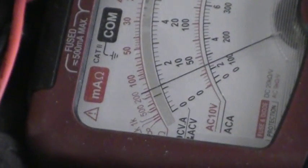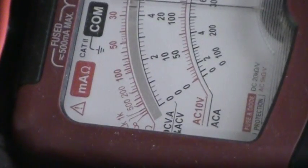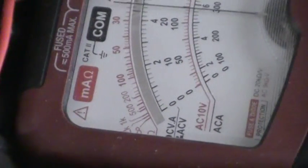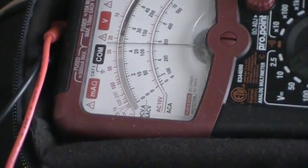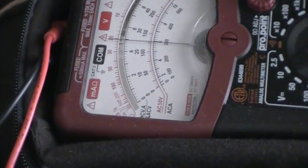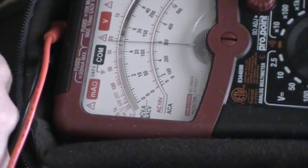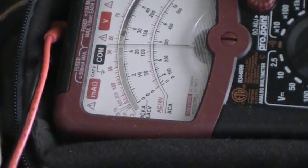I've got an analog meter hooked up here, and it's on the 50 volt scale. Now I'm going to set it to the 10 volt scale. As you can see on the 10 volt scale, I'm just under 5 volts. The reason I'm just under 5 volts is because these LEDs act as a voltage regulator — two LEDs, each one is about a 2.5 volt voltage drop. If I unhook them, the voltage goes up slightly, and if I leave it, it'll even go up more as the energy builds up.